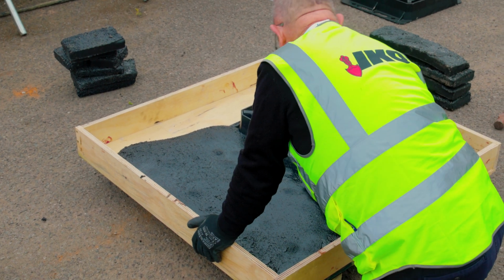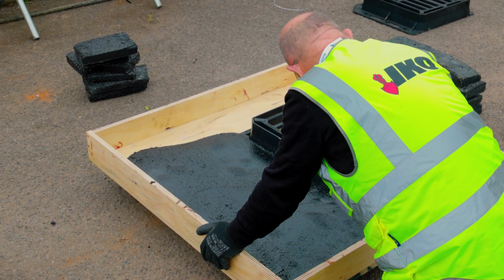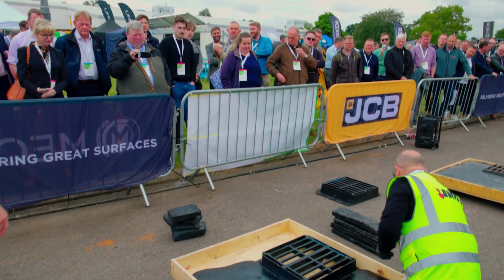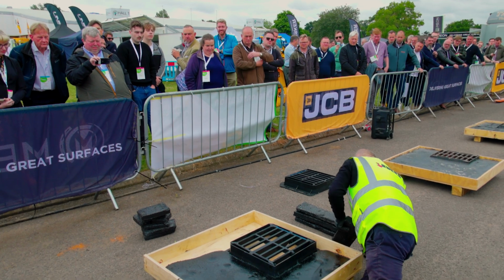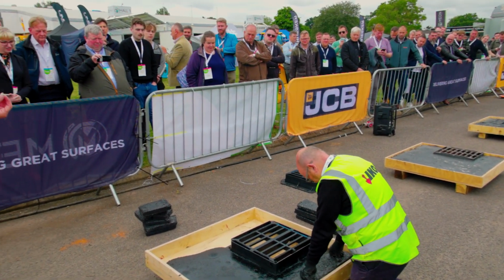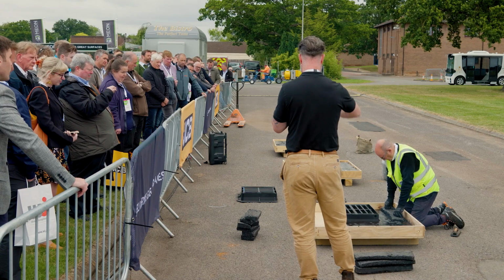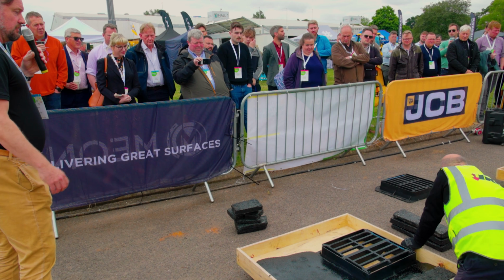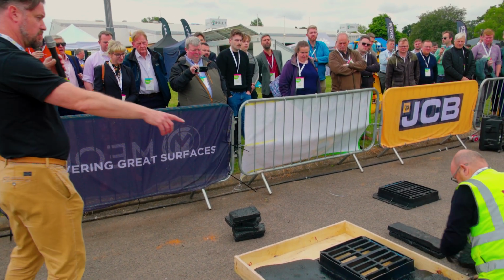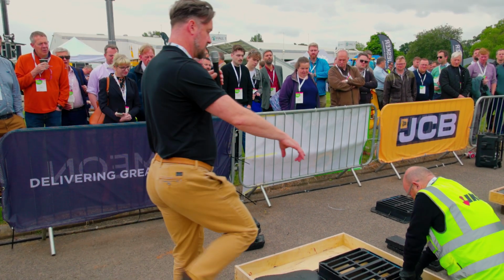The bricks are embedded with a 10 mil spacing, which we'll see shortly, and they then embed down into the grout with that 10 mil spacing, which leaves sufficient hot material between, so that it all fully fuses and creates a homogeneous volume of the material there. So as you can see, Jack's broken the brick up, so you can break bricks up to get them in and get that 10 mil spacing.